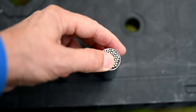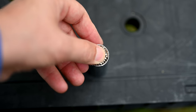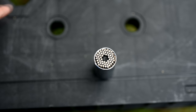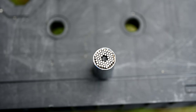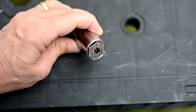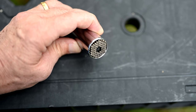Most cheap copies fail between 30 to 40 foot-pounds. This socket also has much better resistance to solvents. On the knockoffs, they use glue to secure the pins to the springs, which is a problem — any cleaners or solvents will dissolve the glue and the rods start popping off. The Gator Grip Universal socket uses a solvent-resistant, high-end adhesive from DuPont called Hytrel, which is an elastomeric resin. It's completely impervious to solvents, so you don't have to worry about rods popping out when you clean it.